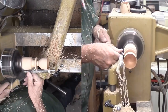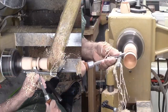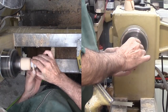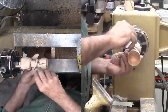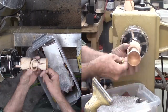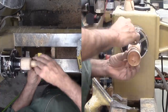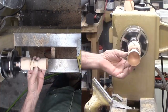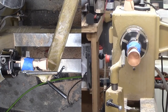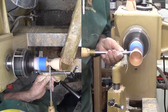I separate the ring but it leaves quite a thin strip of wood on the inside. I'm cutting a flat portion on the stem then wrapping a strip of 80-grit sandpaper around it and anchoring it with a little CA glue. Now I can sand the inside of my captive ring. I try to fuss around trying to sand the ring more with finer grits — that's something I'll have to improve with the next goblet. I try anchoring the ring with masking tape. It works but I feel it is not necessary. The ring seems happy to move away from where I'm working on the spindle. Then I sand the stem.